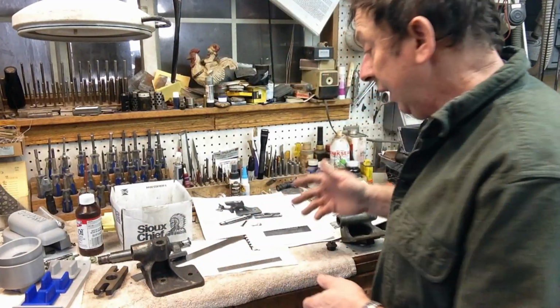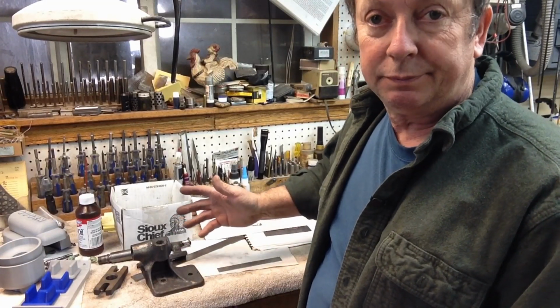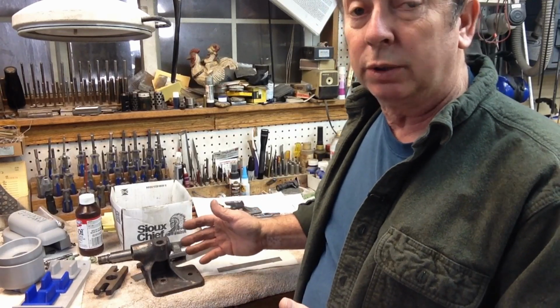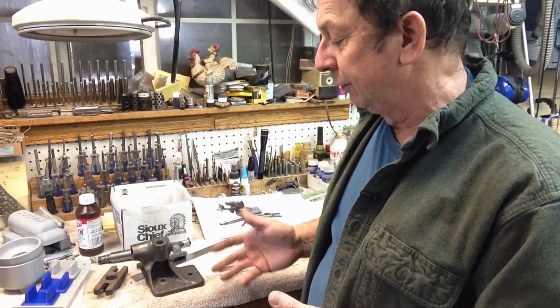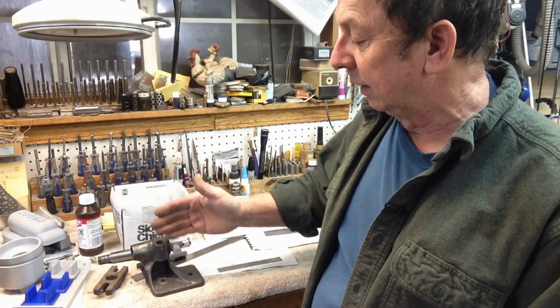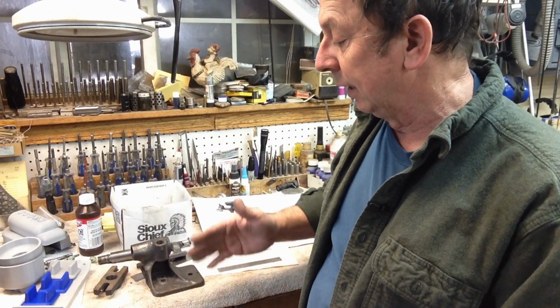Now, when we come to the tailstock, we've got a 3-inch center height on this because we've got 6-inch maximum capacity, and we've got 9 inches between centers, what they call for on the table of the mill. I've already kind of figured that, and just from looking at the drawings, a lot of these dimensions are in the wind. The only thing we're really interested in is alignment through our bore, flatness to the table, and parallelism with that.